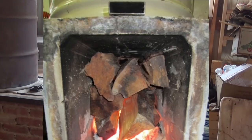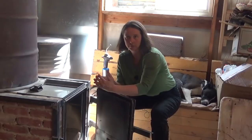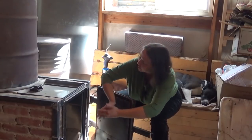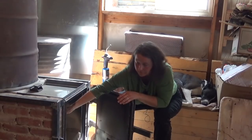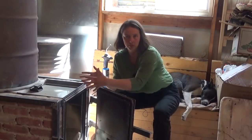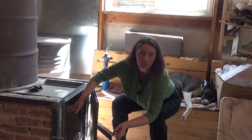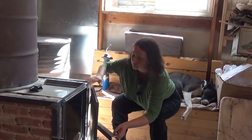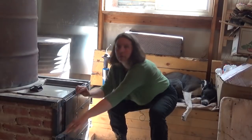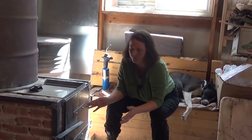That's one thing a lot of people miss when trying to run these stoves for the first time. Peter will start the draft with a little fire — small sticks, paper, and tinder — not in the slot or port, but just a little bit back from it. When that fire is going well and the draft is established, then he'll load the batch. He's got a nice little fire going so he knows it's going to catch. Load the batch to no closer than two inches from the top, and leave a little space all the way around the wood for gases to flow. Then just shut the door and leave it. The batch burns for 45 or 50 minutes typically — a pretty regularized burn cycle. You can load a half load or a full load and it's still about 45 minutes; it just burns hotter with a full load.